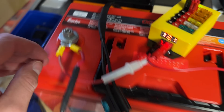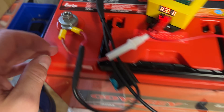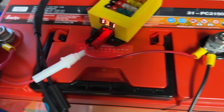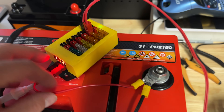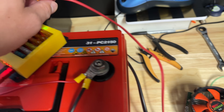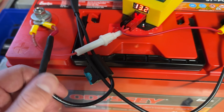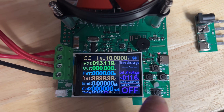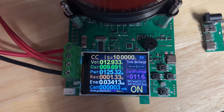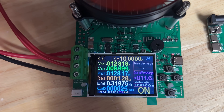I've hooked up a couple of things now. Unfortunately the battery lugs are rather large, so I've jammed them in between a couple of washers and they'll be fine for carrying the current. I've got one set of leads coming off the positive and negative of the battery through a fuse block and into the voltage sensing — reading 13.1 volts at the moment. Then I've got the high current leads going in for testing. I've set it up to 10 amps, and we're going to hit go. That'll ramp up to 10 amps and start the test.